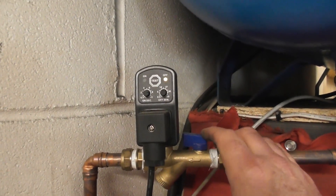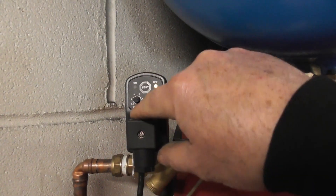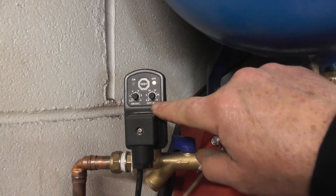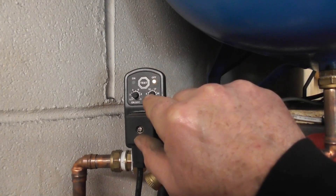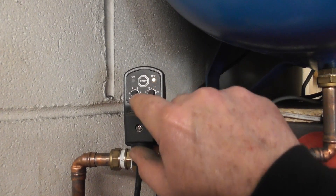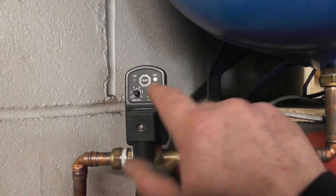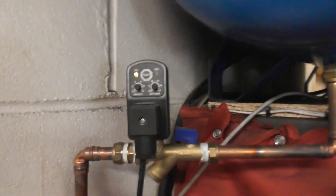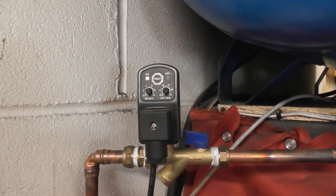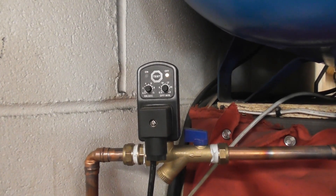This is the valve — this is the auto drain. It's quite simple. I'm showing you the seconds it stays on and the duration of time between each purge, which is that dial there where my thumb is. There are three connectors underneath but you only need two of them. Basically you can fit it to a 13-amp plug — no problems at all. The fittings I've used are all plumbing fittings. I've never plumbed anything before but it all seemed to work okay.